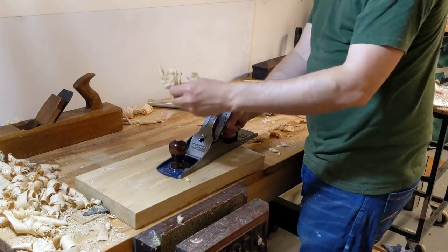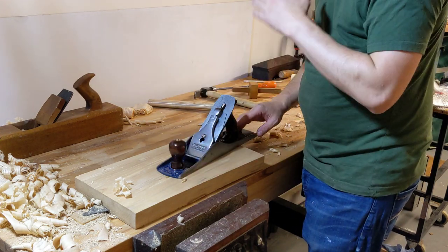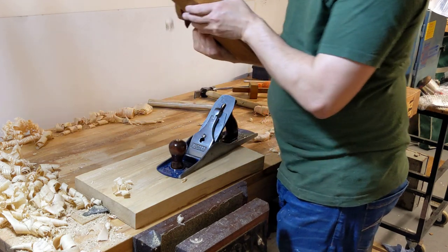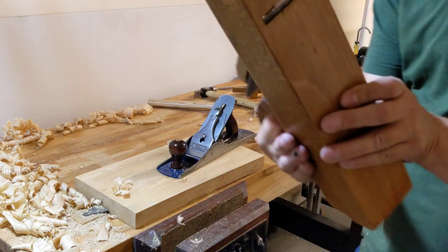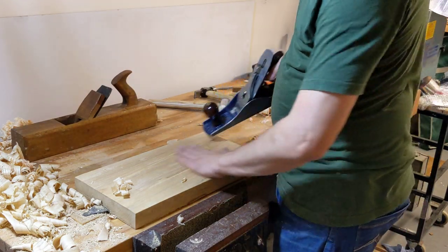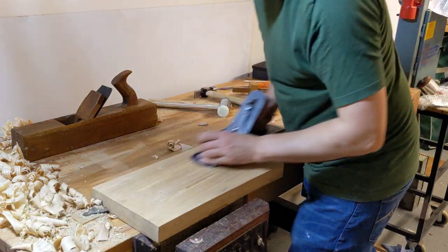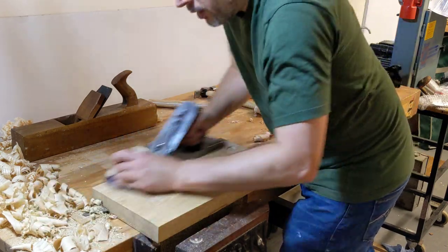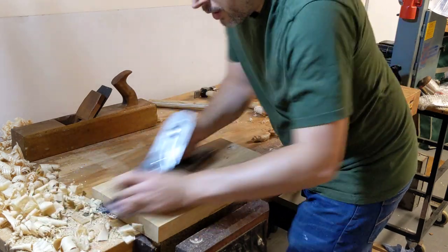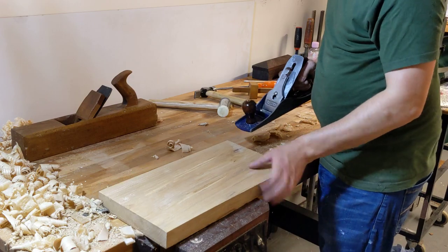For a while, when you move between planes, I've been using that one, which has got a cambered iron on it. It's mainly taking a cut in the centre section of the plane here. You can almost see it maybe in the mouth of the plane, the fact that it's taken out a little bit more there, whereas this one is broadly straight across in comparison, so it's taken out a much wider shaving. And initially, it's just skimming across bits that have been scalloped out. You can soon tell with your fingers